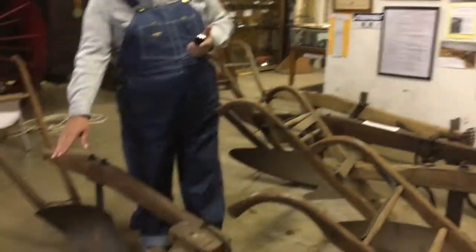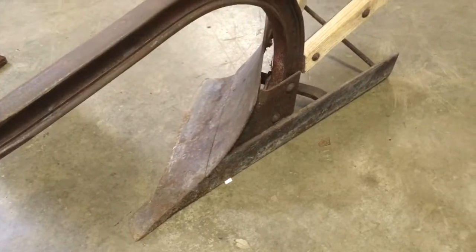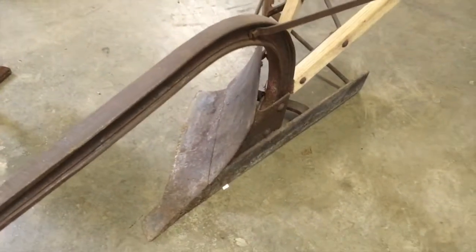The land sides on the plow — the longer parts — have to be longer than the plow lay, otherwise the plow will shove out of the ground and you won't get any plowing done.